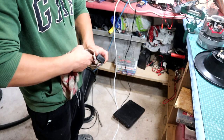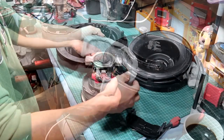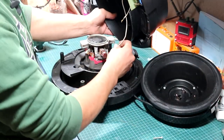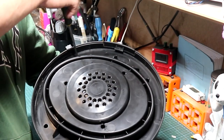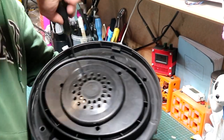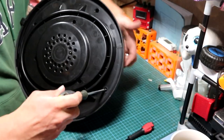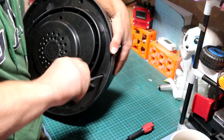Assembling the top side includes cleaning the wire — I forgot earlier — then reassembling it, putting back all the switches, the motor with the foam isolator, then connecting the wire, and screwing it all back. Keep in mind when screwing screws into plastic, you have to turn them anti-clockwise until they snap into place, and then turn them back clockwise to tighten. This is done just to prevent a new thread being cut into the plastic.